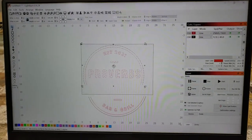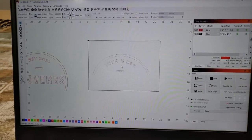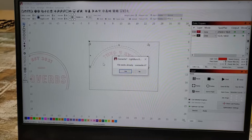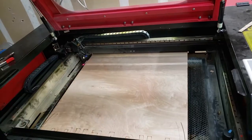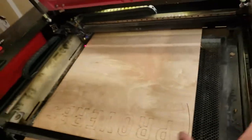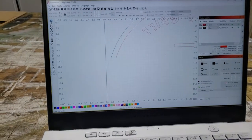That's the first pass done — we did the majority of the sign. Now we have to line up the laser so the existing cuts align when we flip it to finish the full 24-inch piece. We flipped it upside down and are sending it to the laser. In LightBurn we bring up the piece and line it up. To lock the laser position, we hit this little button here — that sets the laser to that point.